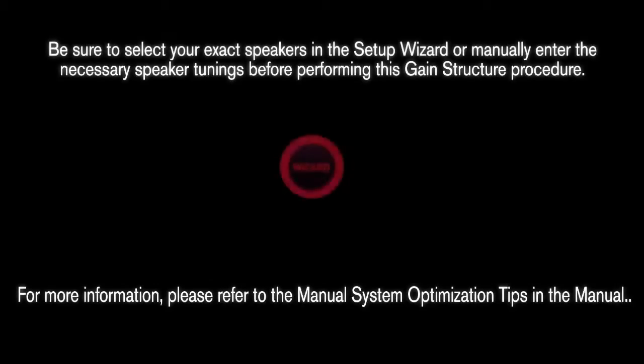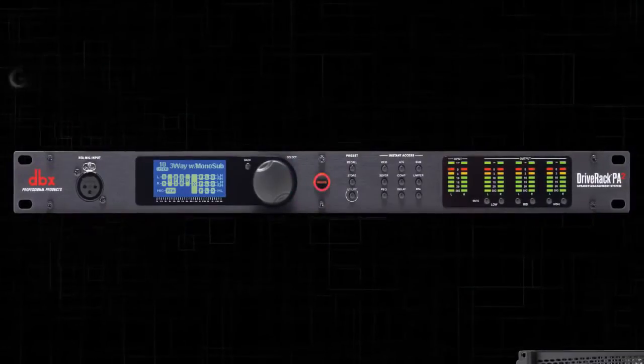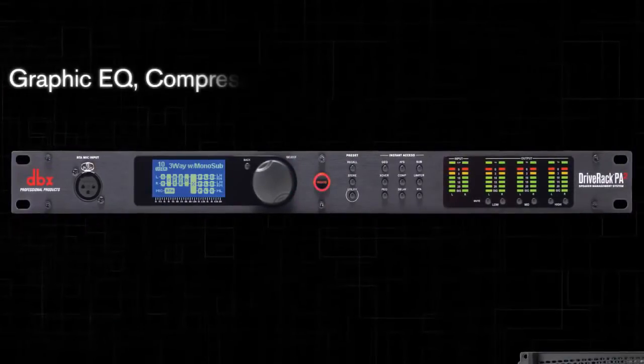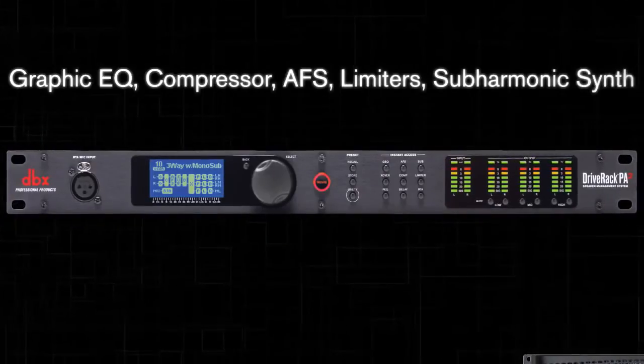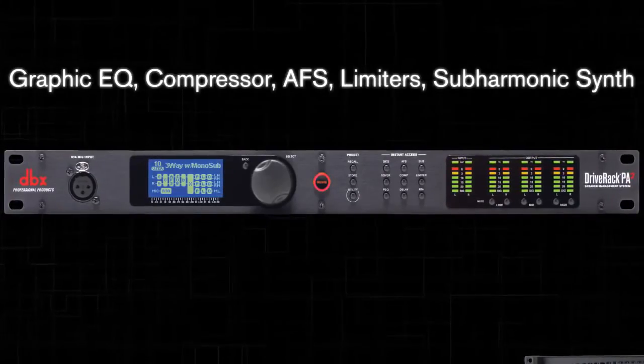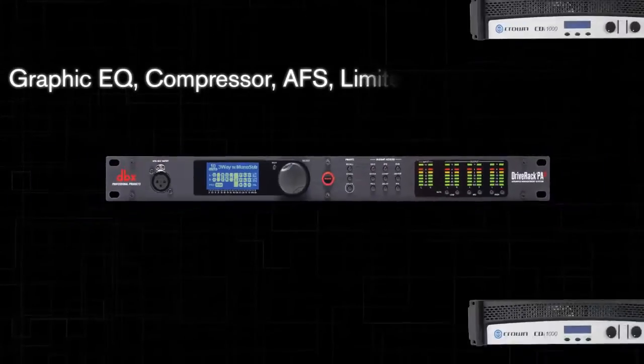If your specific amplifier or amplifiers are not listed in the setup wizard of the DriveRack PA2, this tutorial will show you how to optimize your gain structure manually. First, you need to make sure that any processors that do not pertain to your speaker tunings are turned off before performing this procedure. This includes the graphic EQ, compressor, AFS, limiters, and subharmonic synth.